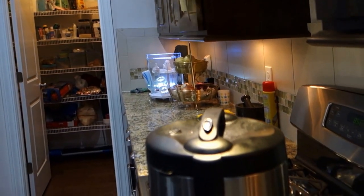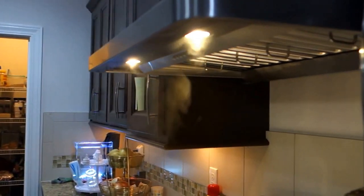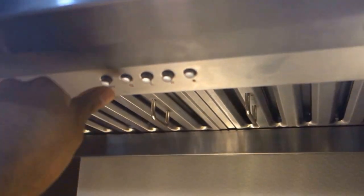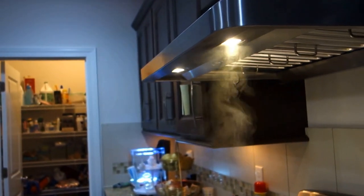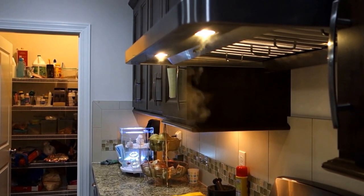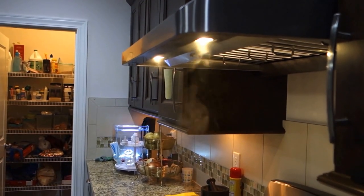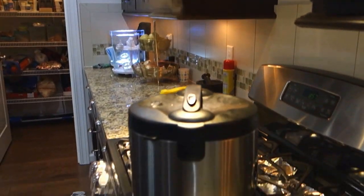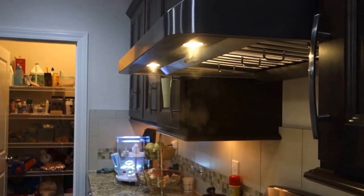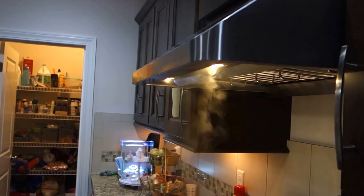Right now this is not on, but because it comes out so far ahead it's still trapping some of the steam — not a lot is going out. Now let's try to run it on quiet mode. It has quiet, low, and high modes. On quiet it runs on 300 CFM — remember the microwave was running on 400 CFM at max. This is the result of 300 CFM — it's picking up, though it takes some time in quiet mode. This is placed at the outer side burner and the nozzle is also placed at the outside. With quiet mode at 300 CFM, some steam is escaping but it's really, really quiet.